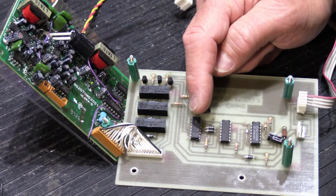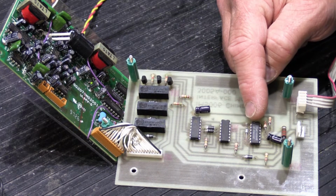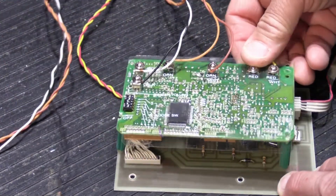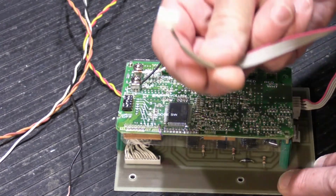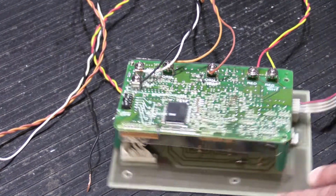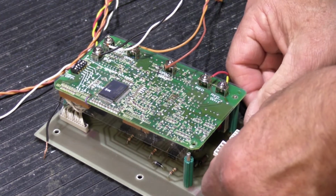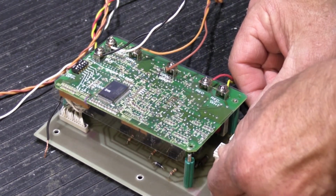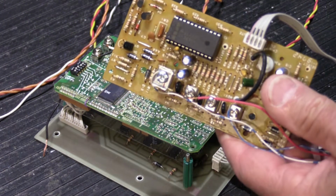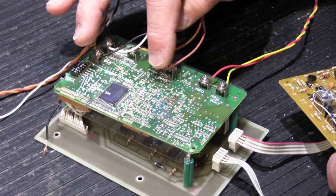So your 3 ICs: this one is a decade counter, this is a gate array, this is a Schmitt trigger. So how does this actually work? Well, this would be assembled like this. This cable plugs into the Chime connection on the back of the master station, and this connection right here is where you plug in the Chime module, like this. And what you've done essentially is you've turned the Chime module into another intercom station in the 5006